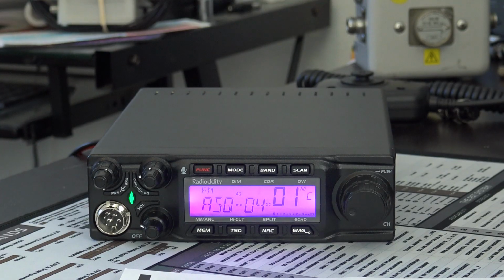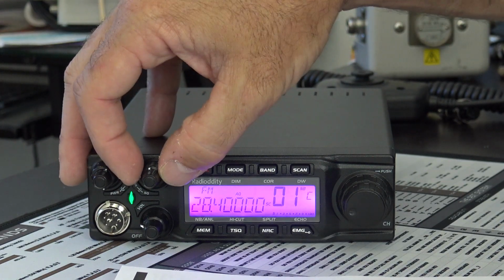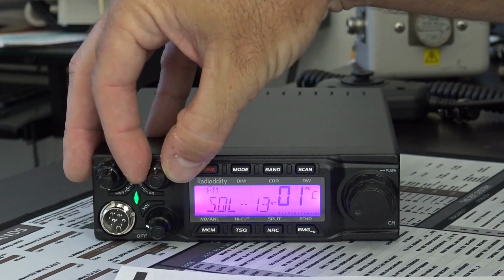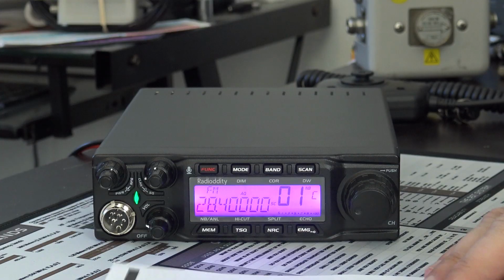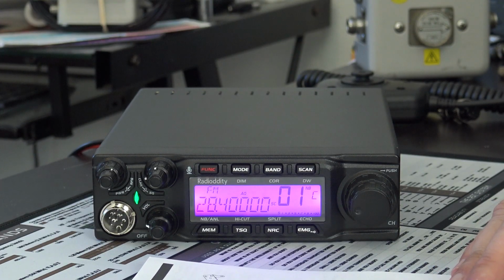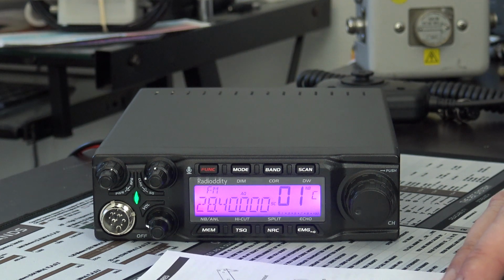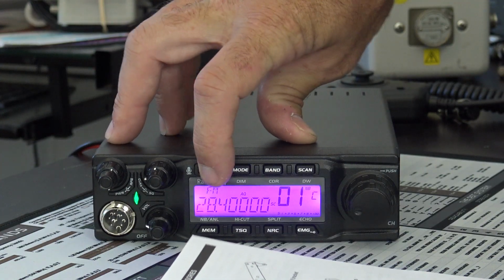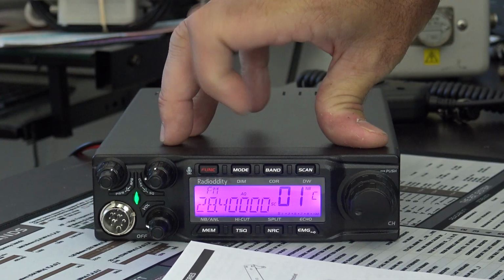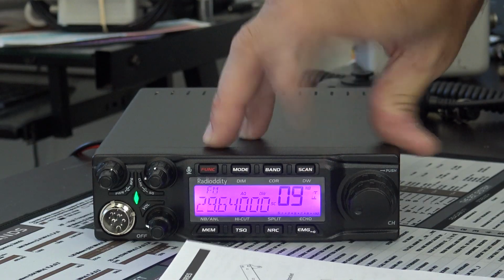And basically, President has that, where if you're in an environment where the noise floor is a little bit high, automatic squelch will squelch everything at the noise floor and down so that everything above the noise floor will break the squelch, okay? RF gain power adjustment, memory channel modes, of course, repeater shift and offset frequency function, CTCSS, DCS, receive and transmit split function, scan, noise blanker, automatic noise limiter, dual watch, love the dual watch, hold function, no, I'm sorry, quick function, and then scan.